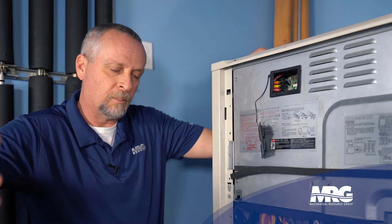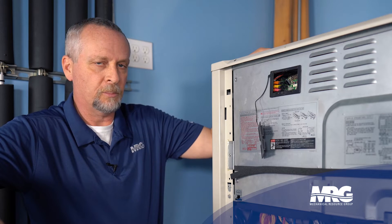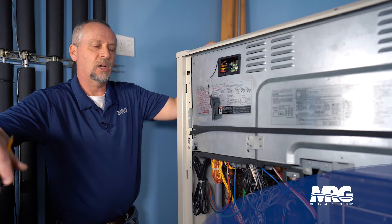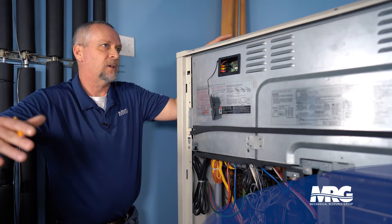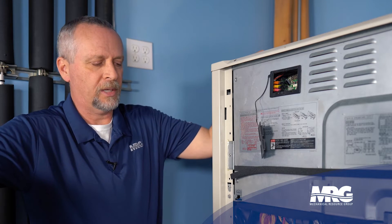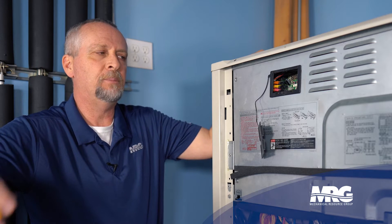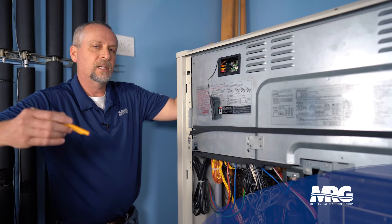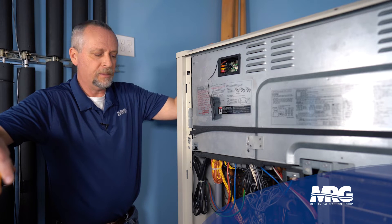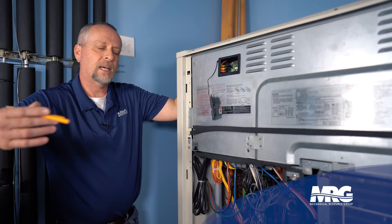Basically, what emergency operation mode is in a Daikin VRV system — in this particular condensing unit, I have two compressors. We're going to go through the scenario where one of these compressors has failed, the system has coded out in a fault, perhaps an L8 fault, L5, an overcurrent, something like that. I run the service call, determine I have a bad compressor — perhaps locked up or windings open. With Daikin VRV systems, I can go into the emergency settings in the main printed circuit board, called the A1P board, and lock one compressor out to return the system to operation. I'm going to walk you through how we do that.